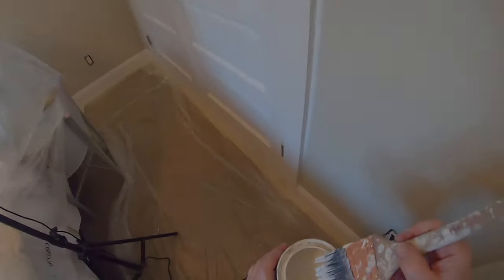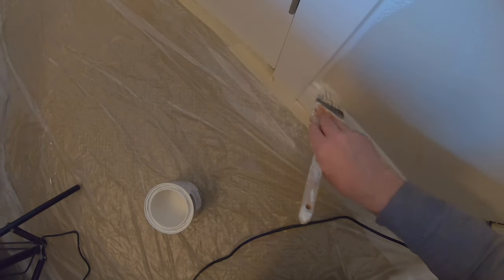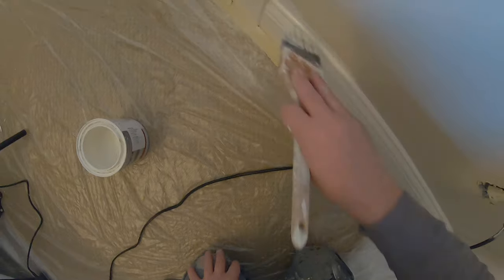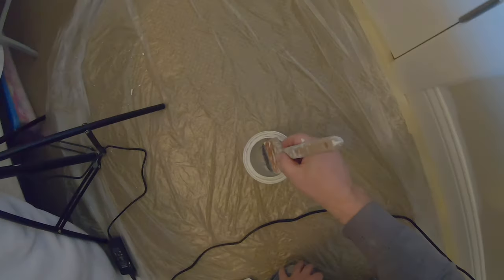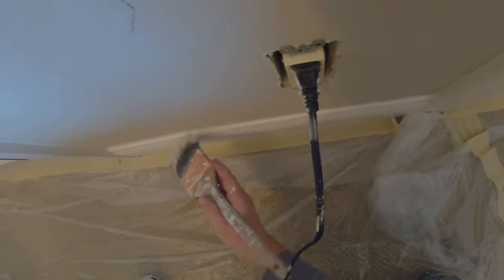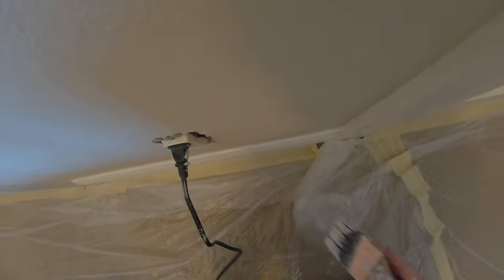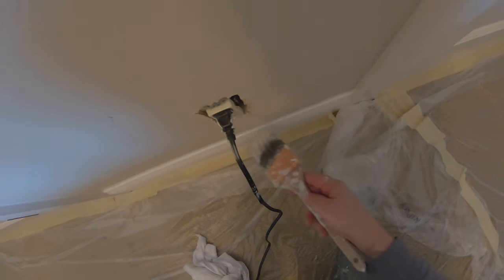This has what's called a pretty, well, it's not a long open time. Open time just is the amount of time you have before it actually starts to dry on you. This product has a little bit longer open time. Now, I'm just painting this top part right here, and that's it. And then once all of this is dry, and this takes a while to dry, this actually takes 16 hours to dry. So I will be waiting until tomorrow to tape it up. But if you use a different kind of latex paint, that usually dries in about 4 hours.